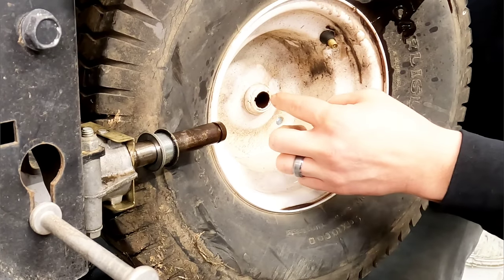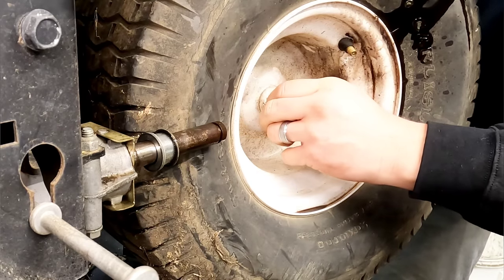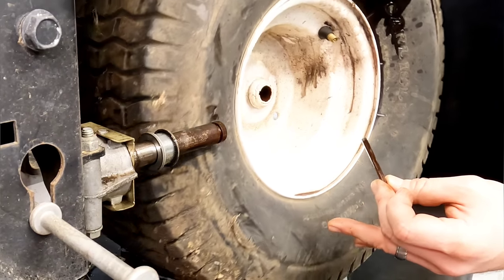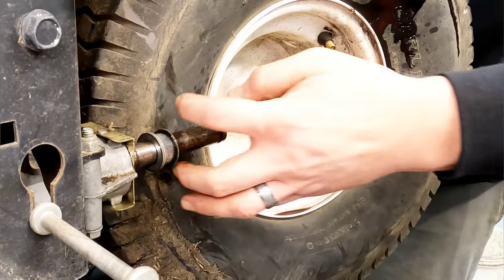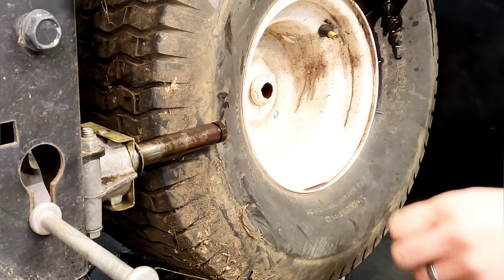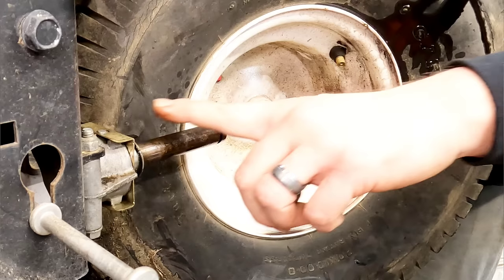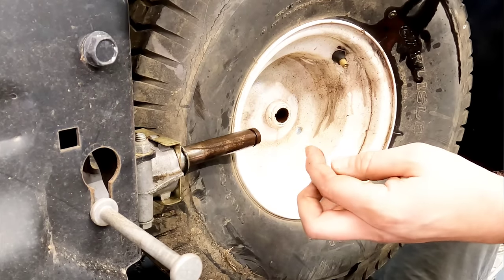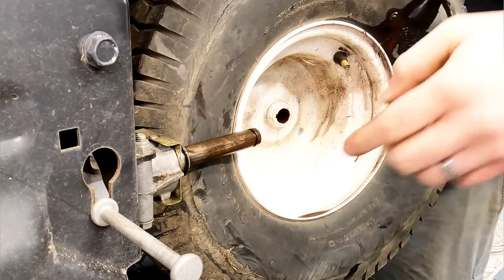As we look down inside, the key is in there. It's not hot because the shaft heats up way less quickly. Make sure you don't lose that key — it needs to go back on. While we have this off, we're going to clean this all up on the inside, probably just use a pipe brush all the way along to get that rust cleaned up. Then we'll use sandpaper all along here to make sure it doesn't get seized back on again. There's rust all over it, but it's got lubricant all over it at this point. That lube helped out a lot, and so did the vibrating and the hitting.